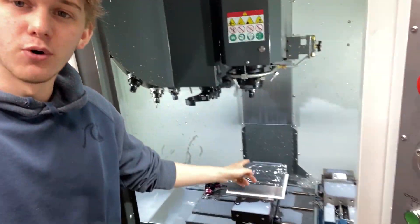I figured I'd show you the good, the bad, the ugly. The mold's working but I keep breaking sixteenth inch end mills. I ran the first one just fine — even pushed it 50% faster — but with this mold I've broken two. They are very long end mills, 0.600 length of cut. Luckily I got through half the cavity work and I can use my standard eighth inch length of cut sixteenth ball to finish it out slowly.